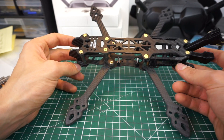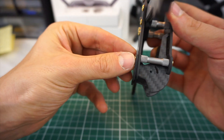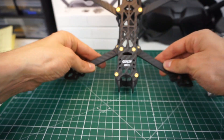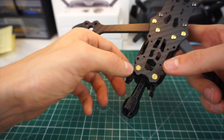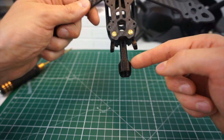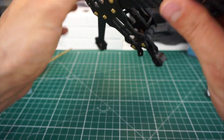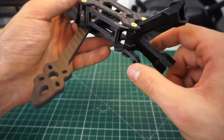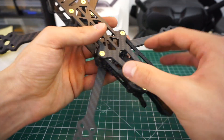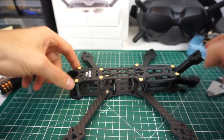It's possible to build it without the DJI unit in a classical analog setup. The extra bumper plates in the front give a total thickness of 5mm, which helps if you really slam it into the ground. There's also one in the rear, which is now pretty much covered by the TPU — a leftover from the original design. A really cool thing is it comes with a dedicated crossfire antenna mount, which fits really nicely — no issues fitting the printed parts at all.